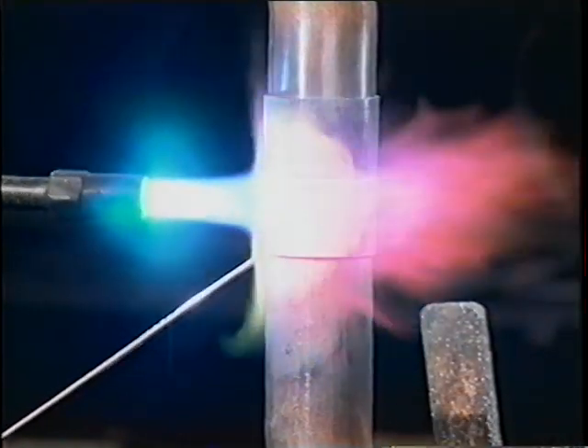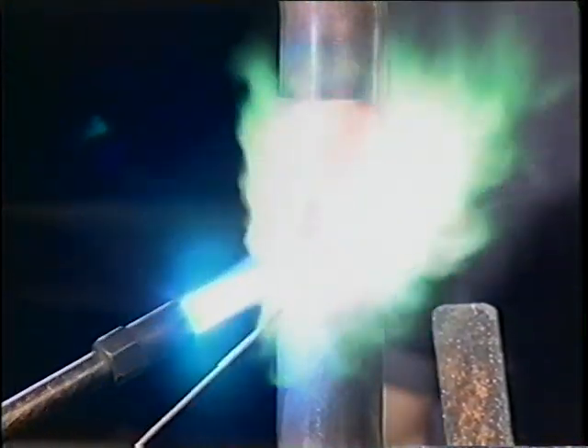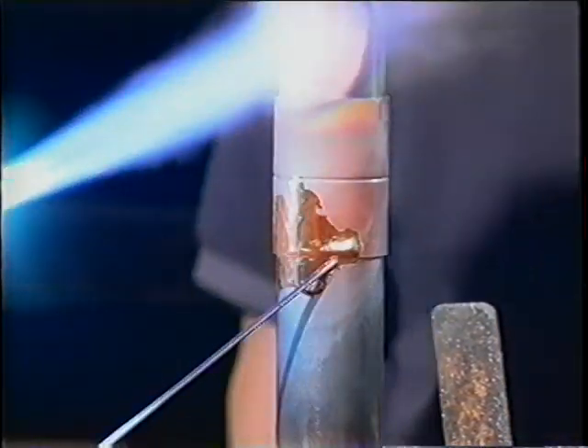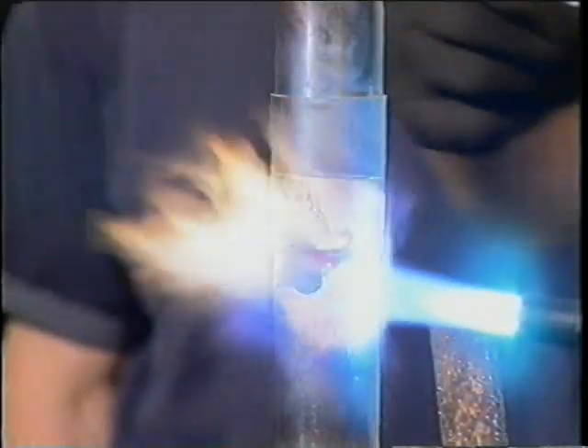Starting from the bottom of the fitting — that's correct, because heat rises, just like it did on the horizontal. We start at the bottom because we're only going to do one upfeed joint. I'm going to cap it around there and come around and do the other side.